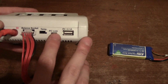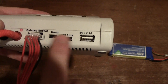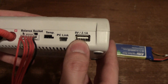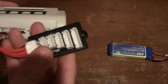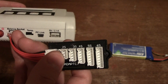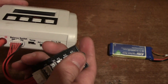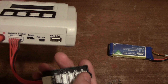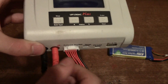There's also a PC link port for data and probably firmware updates, which I haven't used. Then you have a 2.1-amp, 5-volt USB output — great for gumstick batteries in tiny whoops. The balance plug on this charger supports 2S, 3S, 4S, 5S, and 6S, so it can charge all the way up to 25.2 volts maximum.